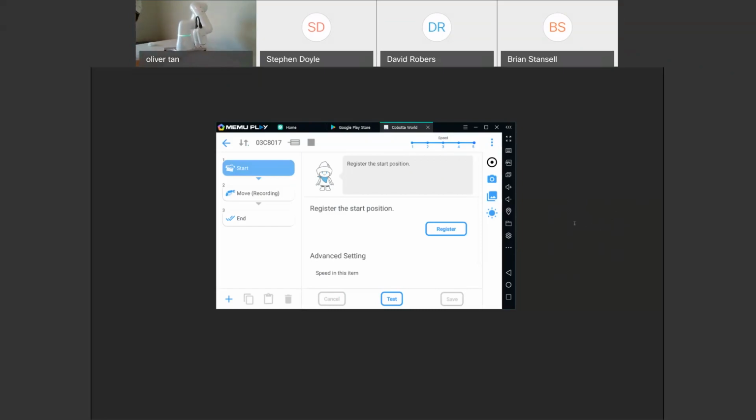What is shown in this demo is the COBOTTA mounted on our optional base. So yeah, like I said, this is an optional base that we sell for the COBOTTA, and it allows the user to pick and move the robot to other applications. The COBOTTA base comes in two parts, an upper and a lower section. So the upper can remain attached to the COBOTTA and it can be easily transferred to different fixtures as needed. The COBOTTA bolt mounting pattern is available in the manual. It's also possible for the customer to create their own base. So yeah, thanks guys for answering that.